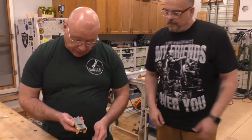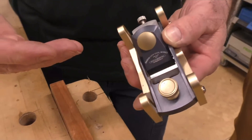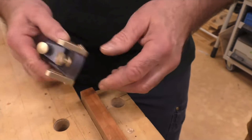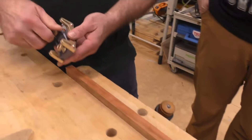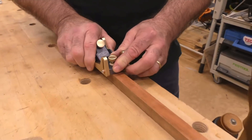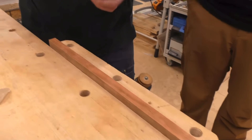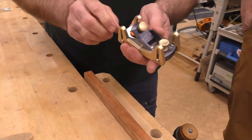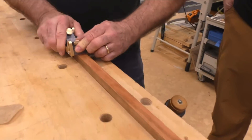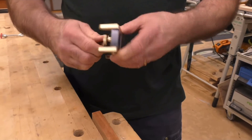Let's set depth on this before we get going. One of the things I want to point out is you don't have to loosen it a ton to get the forward momentum. Let's take a quick swipe — I'm not getting anything right now. I'm going to just loosen it a little, about a quarter turn. You just got to work up to it. Almost got it — let's just get the right pressure. Not taking much. Just a hair more — just a fine adjust. It's so thin, it's crazy. See how I'm starting to get that? It's very thin, so you might give it a little bit more bite. You just work your way up like that.